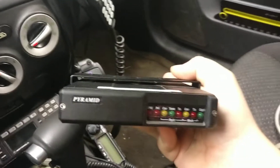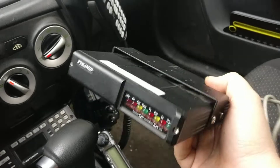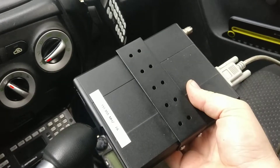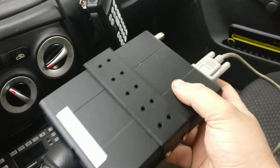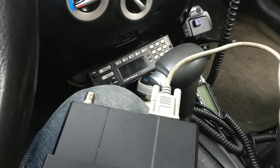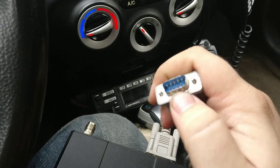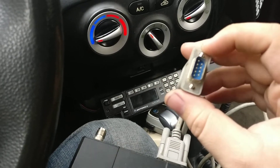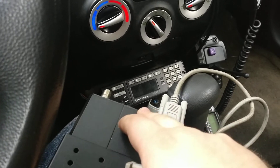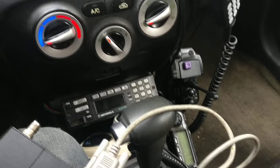Two other things I'm working on: this is a VHF pyramid repeater, meant for in-band or cross-band repeating. This is a VHF model, which I can't really use in my case because you're not supposed to use two meters as your control channel. So I do have a UHF model coming in. The port that handles your push-to-talk, squelch detect, and everything uses a standard serial port DB9 — it's not RS-232, it just happens to use this port. So I'm thinking I can get a serial port three-way or four-way switch, get the UHF model, and put it in the car — two watts UHF. The idea is I can take my XTS-5000 out of the XTVA when I'm mobile.